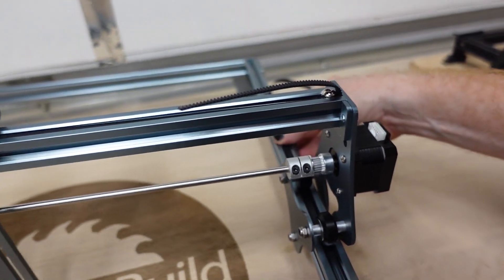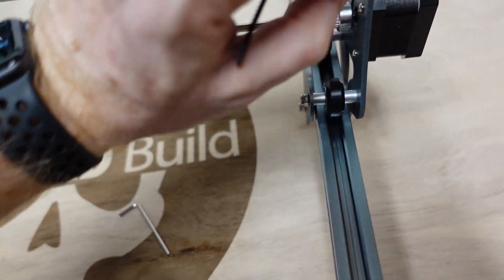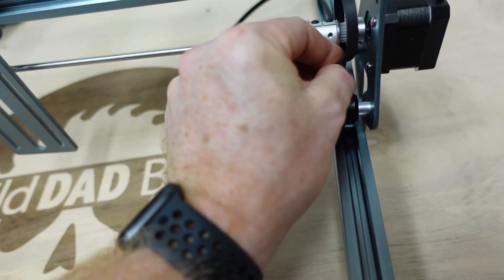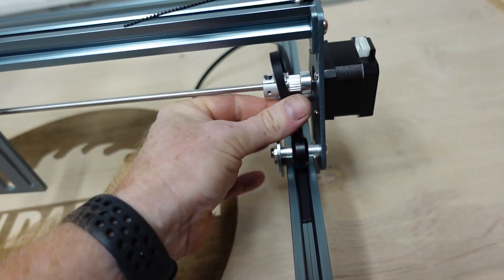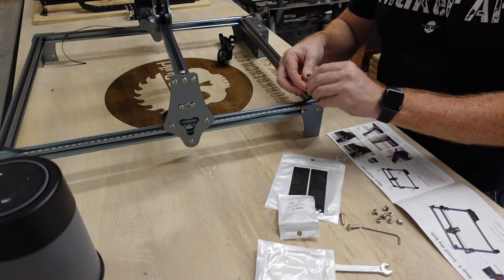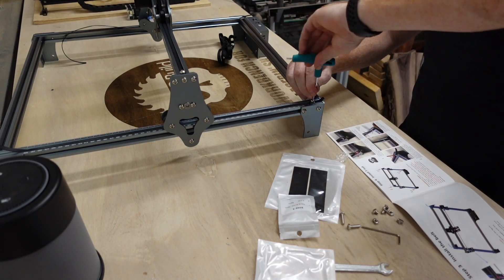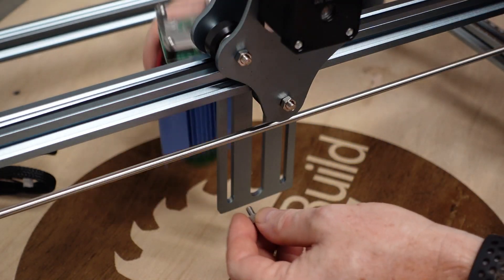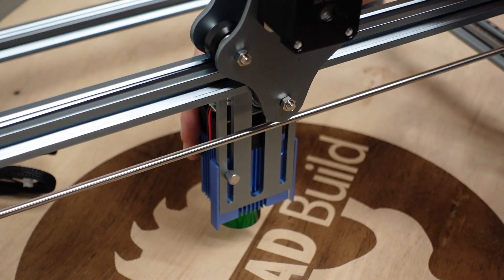Underneath the first wheel — once you get it up around that wheel, bring it over here. That's what moves the gantry. Then you feed this back down through here and make sure those teeth are tracking. Next you're gonna drop a T-nut in the track, then screw in, apply a little pressure and start turning. Basically I'm going to take the laser module and screw these into the back — this is how you adjust it up and down.